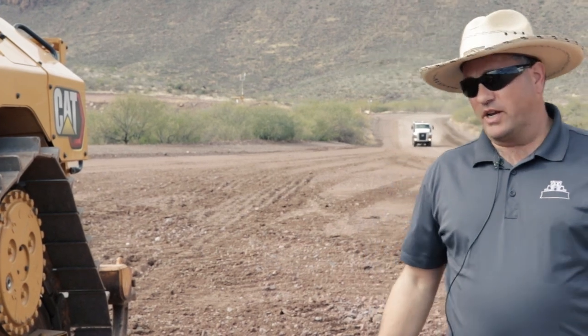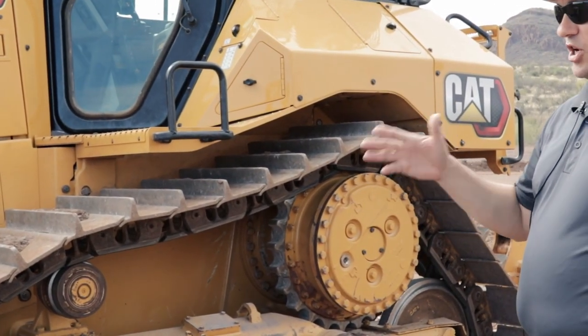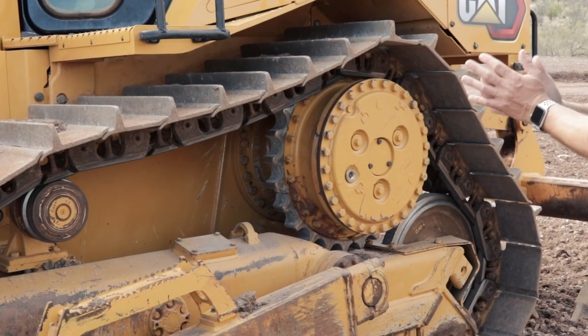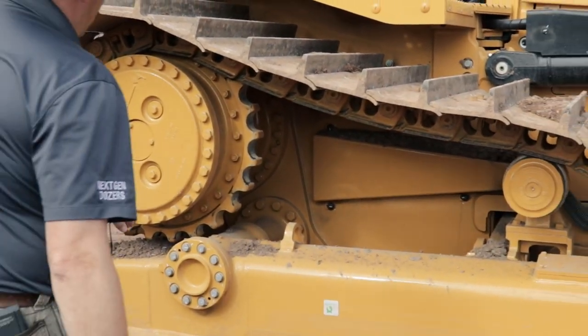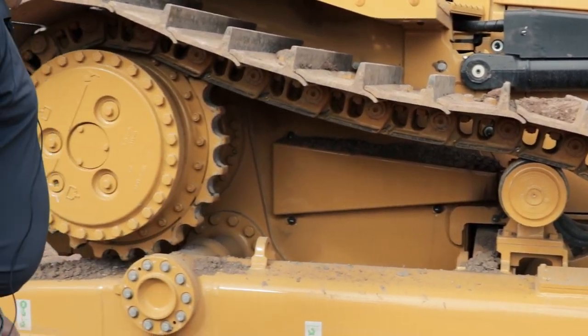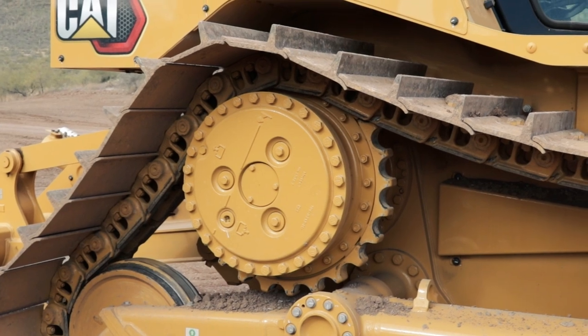Working into structures: we've built up the structures of this tractor, with a brand new blade structure, heavy duty L-shaped push arm, ready for the hardest material. We've also got a new roller frame on both tractors — similar design to the new D6 and D6XE program, just scaled down for the D5. We increased the size of the casting for the pivot shaft and the cross section of the tube going back to it, improving durability in that pivot shaft area.